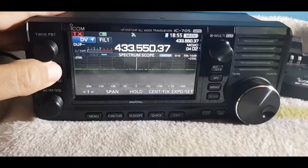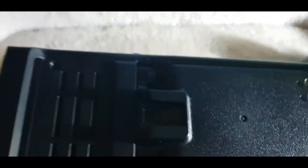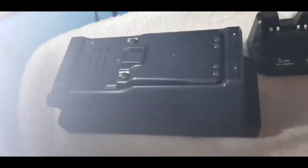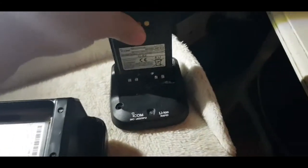Just to be safe I'll turn it off and turn this over carefully. So you can see I've got the ICOM ID-51 charger here. Now the radio will charge the battery when it's plugged into the radio, and the radio will work at the same time. I'll get my fingers in there, pull those two little tabs down — it's a bit fiddly, stand by one sec. That was a bit easier when I had two hands, but anyway it's coming off now. There's my little ICOM torch giving us a bit of light, so it lifts up — as you can see, normal ID-51 battery.